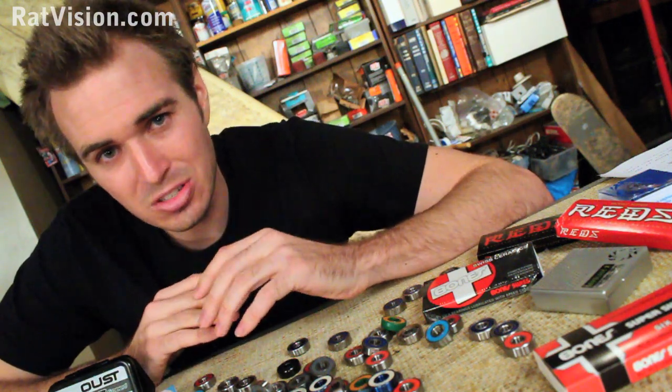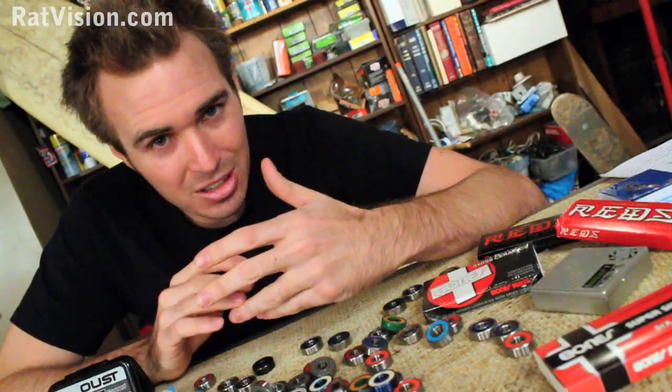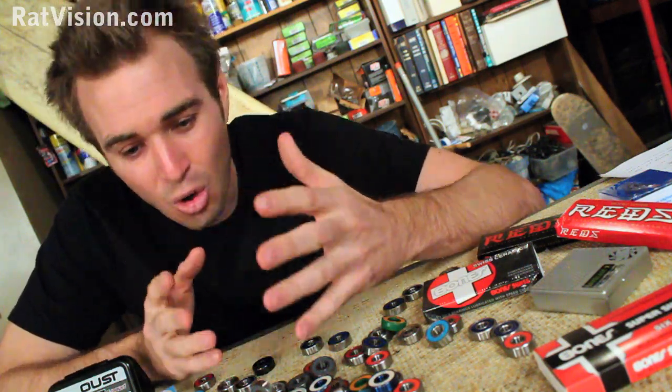So how does ABEC affect performance? Well, ABEC only measures tolerances — it does not rate speed, durability, ball sphericity, torsional loads, axial loads, surface finishes, torque, or lubricants. So an ABEC 3 can actually be better than an ABEC 7. The ABEC rating does not apply to skateboarding because the tolerances set in the ABEC scale don't match what skaters do to bearings. Tolerances need to be adjusted outside of the ABEC scale for bearings to handle what skateboarders do to them.